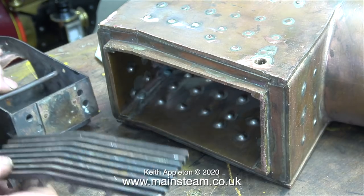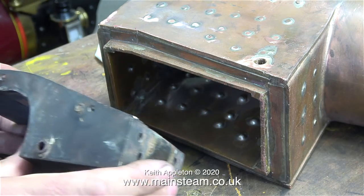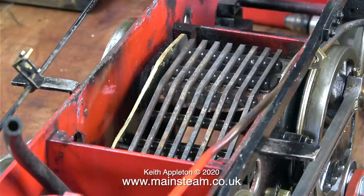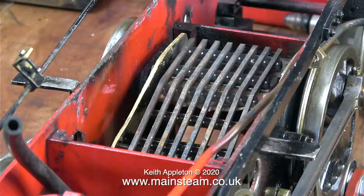I've trimmed the piece of stainless steel grate using my bandsaw, making sure I had positive pressure against the blade at all times. If the stainless steel work hardens, even a new bandsaw blade will be blunted. Around the area of the firebox and grate, everything needs to be a loose fit — if you try and make everything a perfect fit, you'll run into trouble. The dump pin holds the ash pan in place underneath the boiler, but if you want to drop the fire you just pull it out. The ash pan is made of silver-soldered brass, and I've also trimmed that down using the bandsaw. At this moment it's not 100% right, so I'll trim it again; if I spoil it I'll use it as a template to make a new one. This ash pan is not really built as per the drawing at all, but to start with I'll see how it goes.